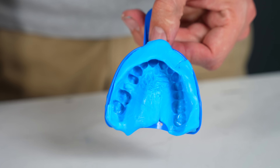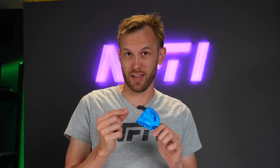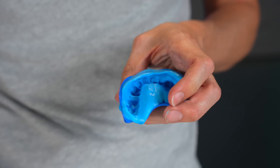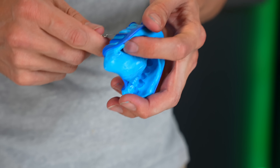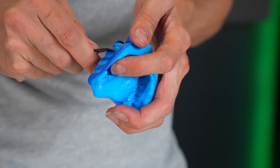So I'm very glad I've got a nice, perfect negative copy of my upper teeth. Now I need to turn that back into a positive, and I'm going to use wax to do that because the casting method we're going to use is lost wax casting. I am going to try and remove the whole mold from the plastic bracket because wax is not the strongest casting substance — I don't want to break the wax version getting it out. I think if I have a little bit more flexibility, that'll be easier.